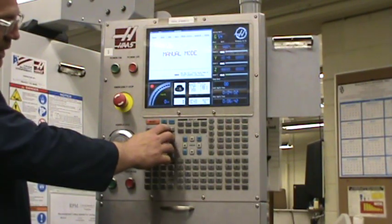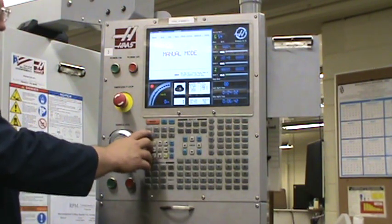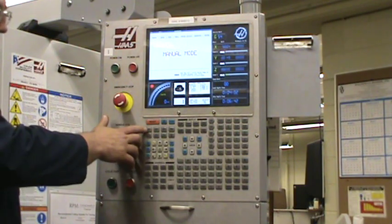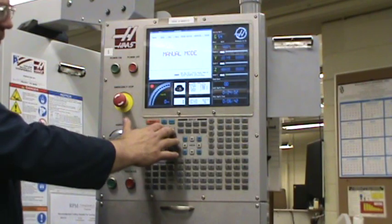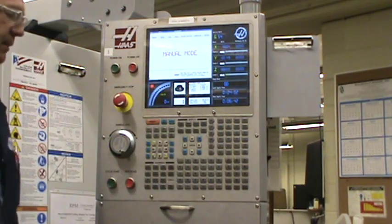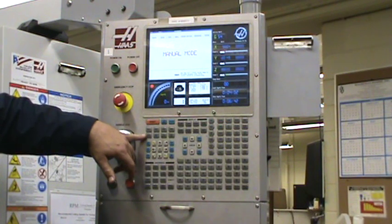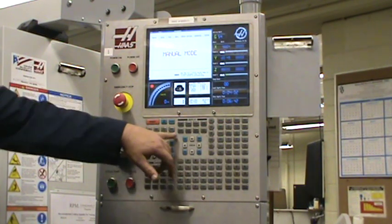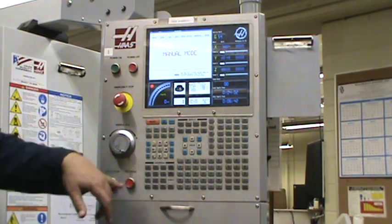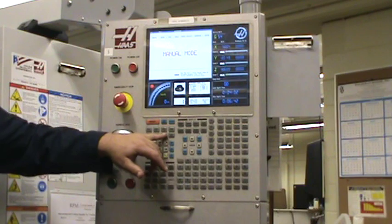Here you've got your F-function keys. These are kind of — I call them the hidden mystery keys. F2 you use quite a bit. F1 you're going to use for entering offsets. F3 and F4 you use quite a bit in the graph. You've got your tool offset measure button — F1 — and your part zero button. Those are the two main ones. You don't really use the next tool or tool release; the tool release is actually a deactivated key.